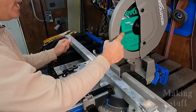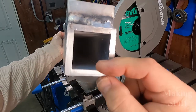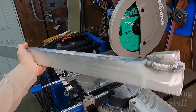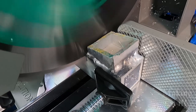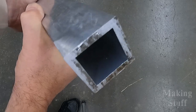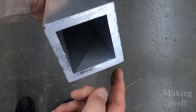The saw is now set up with the aluminum cutting blade. The biggest piece of aluminum I could find in the shop was this two inch square tube with a quarter inch thick wall — a temporary brace I had cut out of the jet boat. I'm just going to chop a piece off the end to see how well it does. The saw had no problems cutting through that aluminum; the chips didn't bind up in the teeth of the blade, and it made a nice clean cut in the two inch square tube with the quarter inch thick wall.